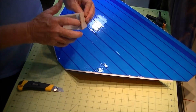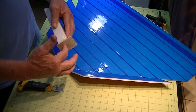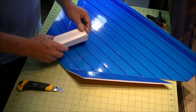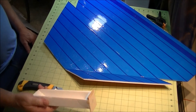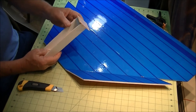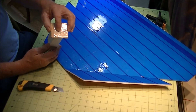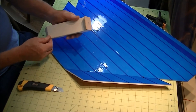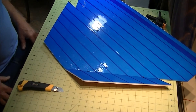It's actually going to go in here like this because this is the motor mount. I made this with a little piece of foam in there because the screws are going to come through, and the battery's going to be up in here — if the battery comes slamming back I don't want it to be punctured by the screws. This isn't hard to build — it's very similar to FlightTest's power pod. You build it similarly: take a two-inch square piece of eighth-inch plywood, drill a relief in the center in case the shaft sticks out, four holes for the motor mount, and tape it — that gives it a lot of strength.